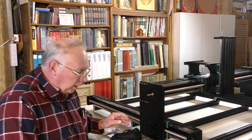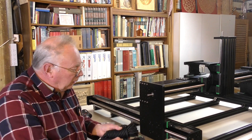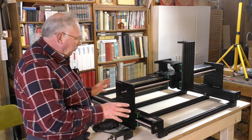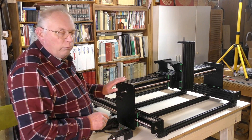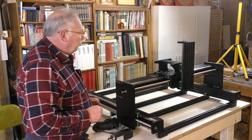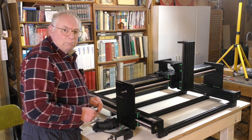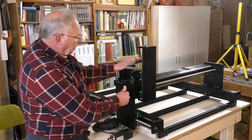What we're going to do today is install these beautiful hybrid servo NEMA 23s on all the axes. But before you go any further with your build, go around the entire machine and check the tightness of every single screw, nut, and bolt. Then check your axes for free movement — not by turning the screw, but by catching hold of it and pushing it.